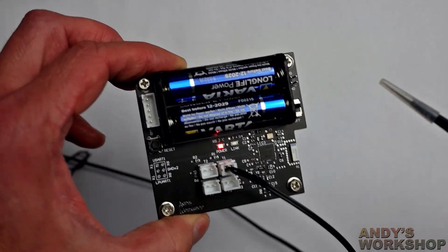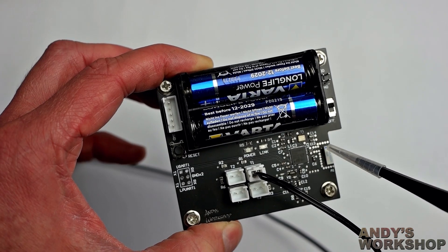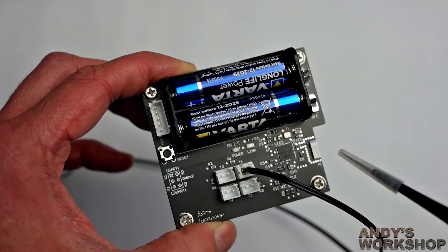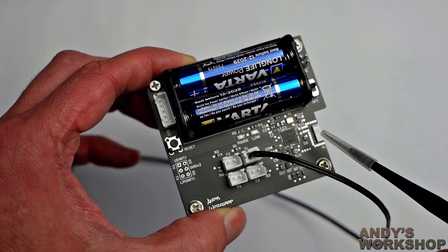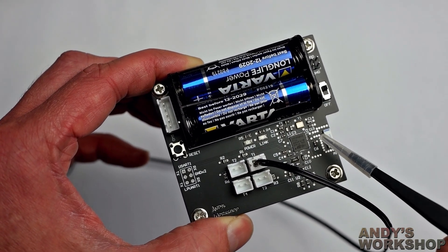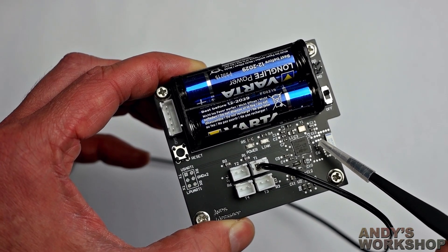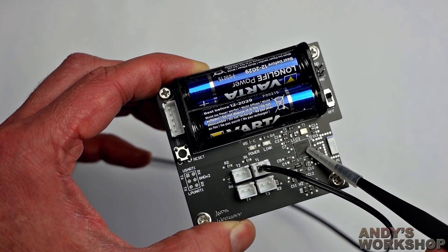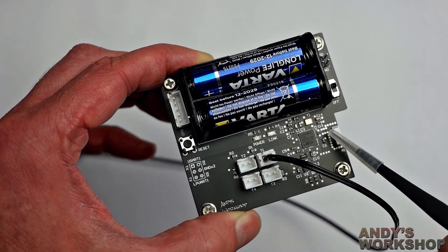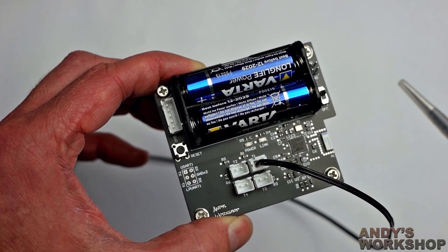If I just bring it a little bit closer, we have the WB55 there and the RF pin comes out here and goes to a ceramic chip antenna that I used. I'll explain a bit later about the mishaps I had with getting this design to work. I am not an RF expert and I was put firmly in my place by trying to be one in the previous iteration of this design. The working design here is using a ceramic chip antenna. What you can't see because it's way too small is a filter package, an MLPF format package made by ST. It's designed to complement the WB55 and provides all necessary filtering for the Bluetooth signal, centered around 2450 megahertz, bidirectional for transmit and receive.